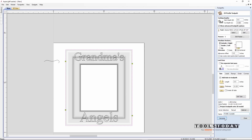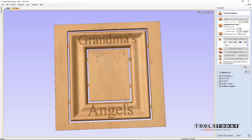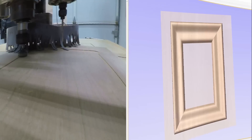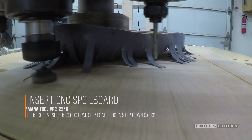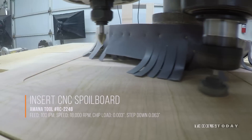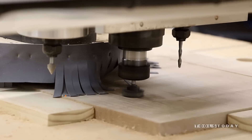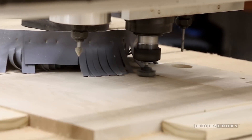If I preview the visible toolpath, I've got a nice picture frame — 'Grandma's Angels' — that I can machine out and put a picture in. This resurfacing bit from Amana Tools does a fantastic job leaving a smooth finish. If we weren't doing the 3D modeling next, there would be very little sanding, if any, needed. It left a marvelous finish — no burning, none of that purple color you sometimes get with cherry. This is just a great resurfacing bit whether for your spoil board or planing a workpiece.